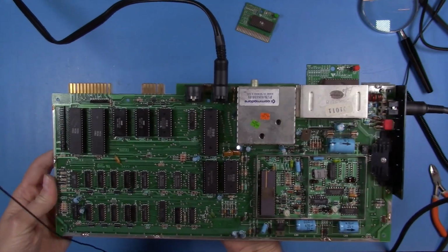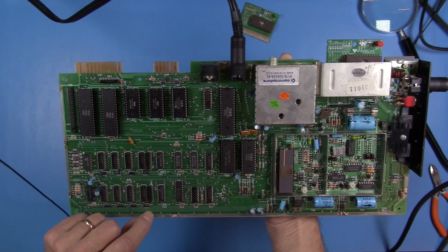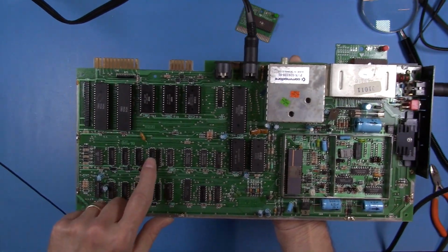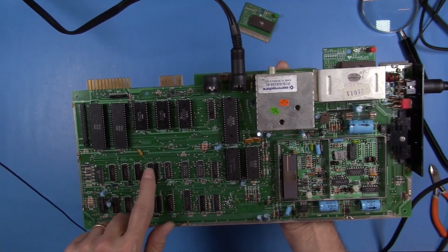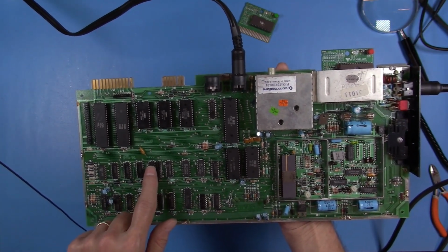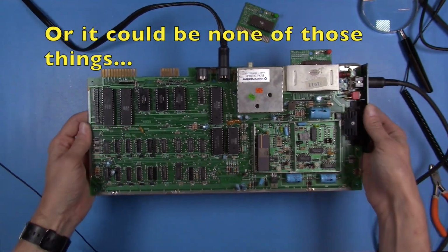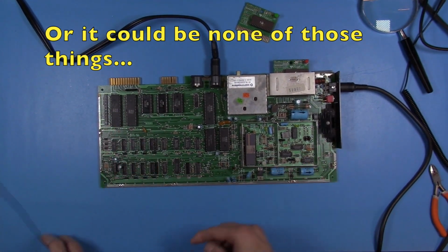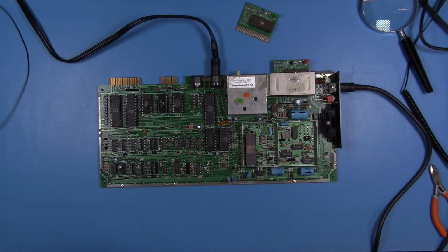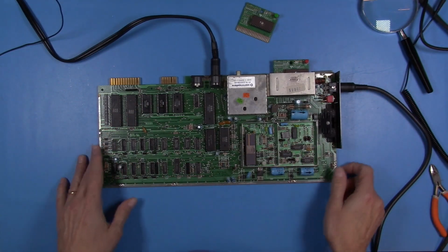that code points to U12, which is this RAM chip right here. However, it really could be U12, could be U12 and other RAM chips. Could also be some of the other supporting chips on the data bus. So it really could still point to anything. But we have a likely culprit in U12. So at least we have something. We do have a flash code.